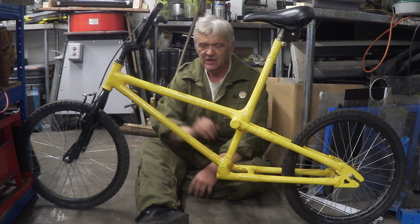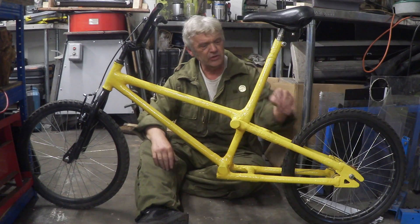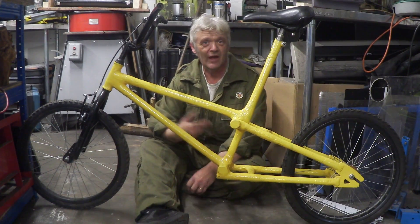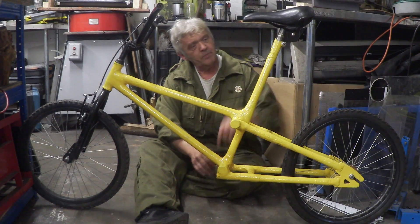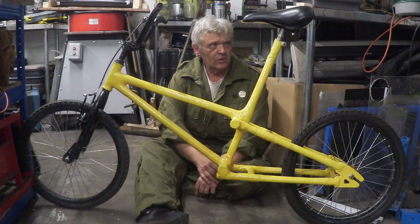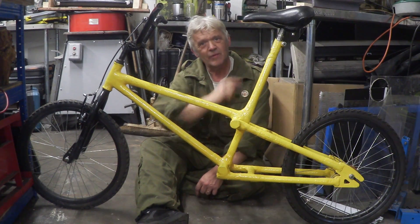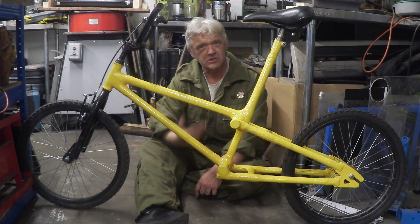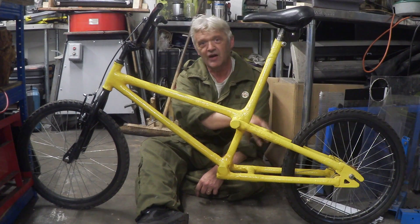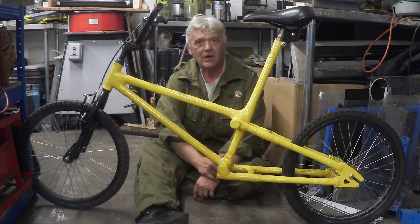All the tubes had their last five sheets with glue applied and the first portion of sheets with no glue. The large poles had 15 sheets total. The stays had 10 sheets total — first five dry, then five glued. This thinner upright had 15 sheets — first 10 dry, then five glued. That's how I made these tubes.